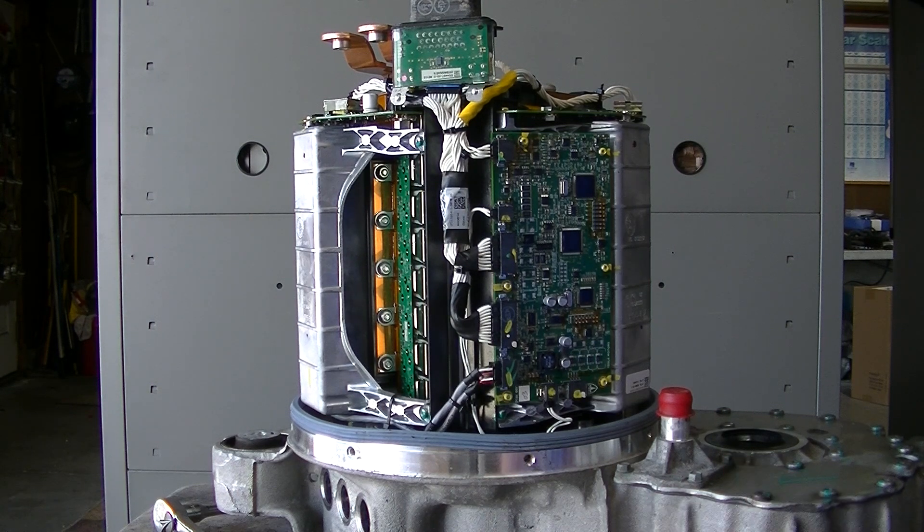This time when I split it, since I'm doing a really trick deal, I'm going to pull that wire out. I did have to take — because I couldn't figure out how to get the small connector loose — I did cut the four wires in different lengths so that I could just solder and heat shrink and put them back in. I lubed the white wire, had to cut a tie wrap off, and it slid out through the hole.